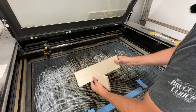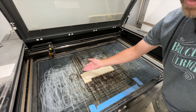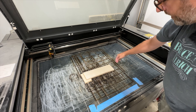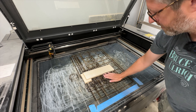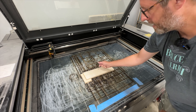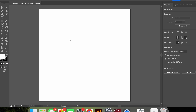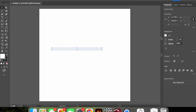To do this, you will need a couple of scraps — I just have some plywood here. You want it to be probably at least a foot long. The gist of it is you'll lay this down and prop it up like this. I'm going to bring my laser over and set it to where it's not going to strike the board but will come very close. You basically just create a line file and run a quick scoring line right here. Wherever it is the thinnest, that's where your focal point is. Then you just measure from your material to where your nozzle is, and that's the ideal height measurement you need to set to get your laser in focus each time.